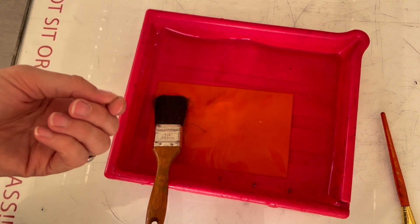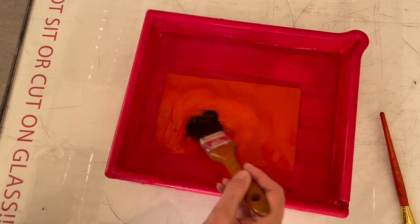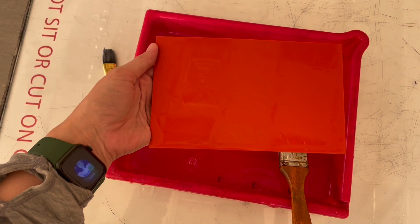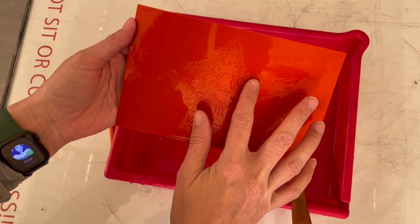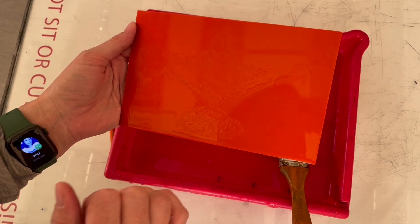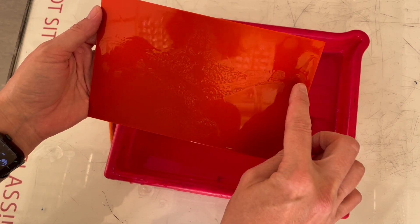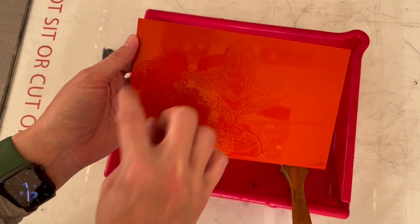I'm checking my clock. I'll leave it in here for about one minute, and I'm just going to scratch the surface here. It's been a minute in the bath, and I pulled it out — I can start to feel some slight recesses, but I think I want to get a little bit more of a ridge. So I'm going to leave it in a little bit longer and really dig my brush into some of these areas where I have some really delicate line.